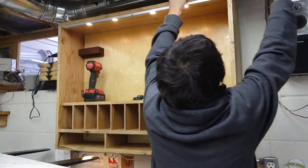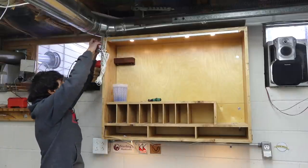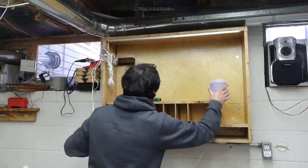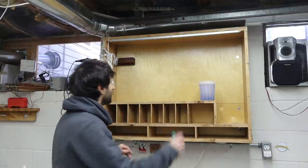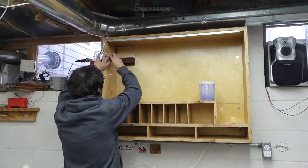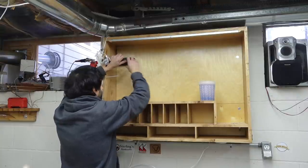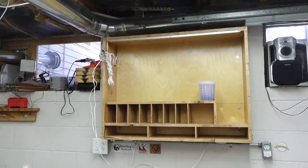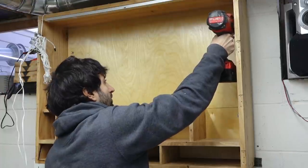This is my number eight with the corrugated sole. I want to get this lighting unhooked, and then I think it'd be good to start dropping this main case off the wall. How this is mounted: there is a lower section with a cleat that mounts to the wall, and then there are two bolts up here which allow me to adjust the plumbness of the case so that the doors will stay closed by themselves. One bolt for plumbing is behind the tall plane till, and the other plumbing bolt is right here behind the mount for the saw till. Those two bolts come out first.